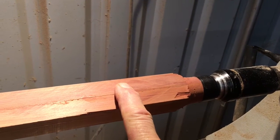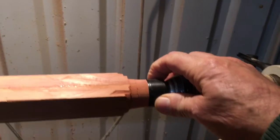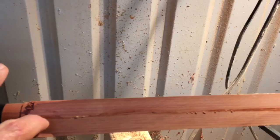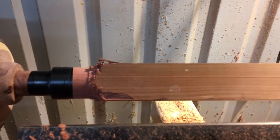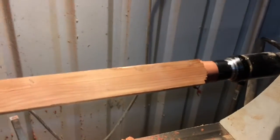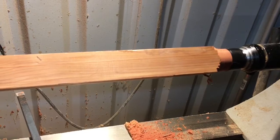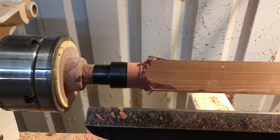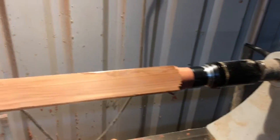I would like a different chucking system, but part of the problem is having the bore already drilled in there - not actually drilled, this is two pieces joined together, although the glue joint is not what failed on the other two; it split in other places. Having that bore already in there, this is the only way I know to be perfectly centered with your hole so you don't end up with an odd shape on your ends, a thin place on your wall, a thick side. This turns out consistently centered blanks - I turn them down to right at an eighth of an inch.